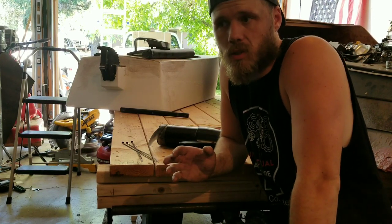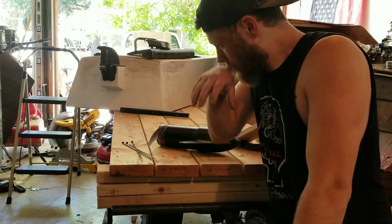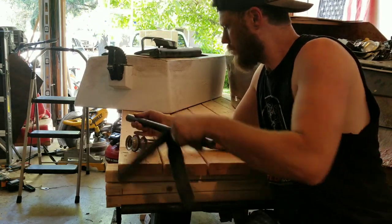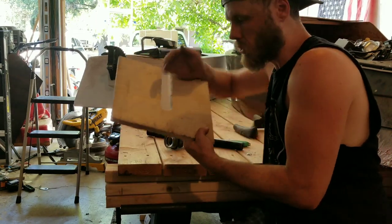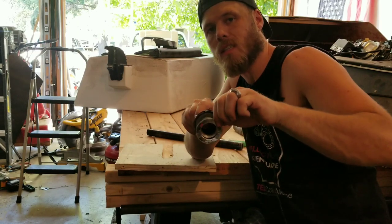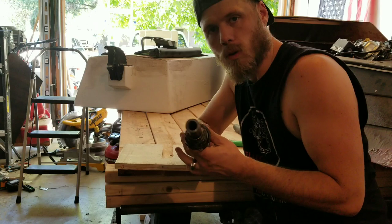This next method is the best method and the only one I use for inboard mounting, but it's probably the worst as far as functionality and skill required — it needs a bit more attention paid to waterproofing. I'll show you what I do for a simple through-hole inboard mount. This is a metal drain for an RV sink. If you get the plastic one, it's too thick.